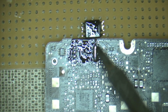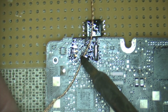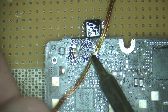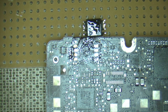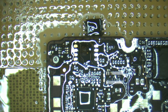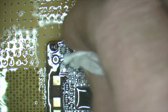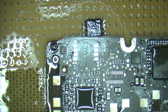Next, what we'll do is clean up the board and get rid of all this excess solder. Use a nice wide wick for this - just apply the wick over the pads, and then go on the other side and clean that up as well, sucking up all that excess solder. Apply some isopropyl alcohol and get in with some technical wipes to clean that area of the board and get rid of all excess flux. Our pads are now clean for the new chip to be reapplied to the board.